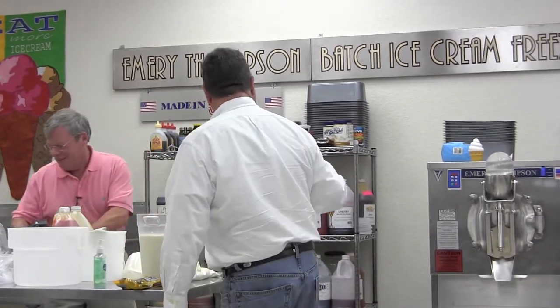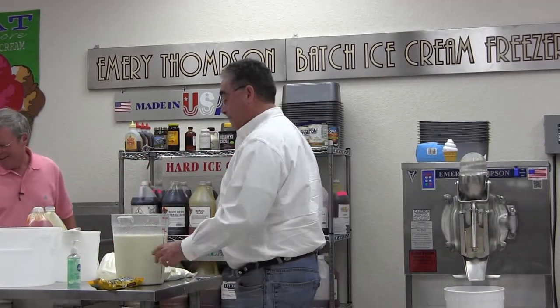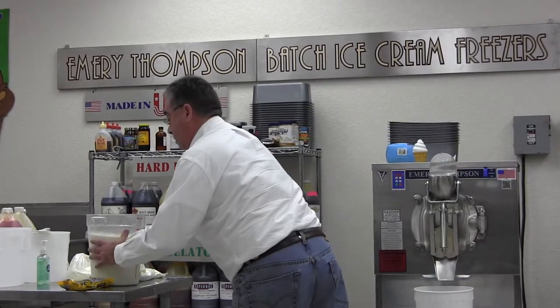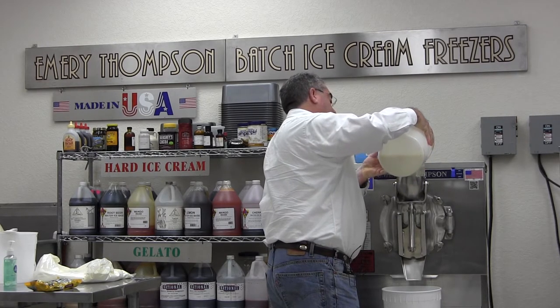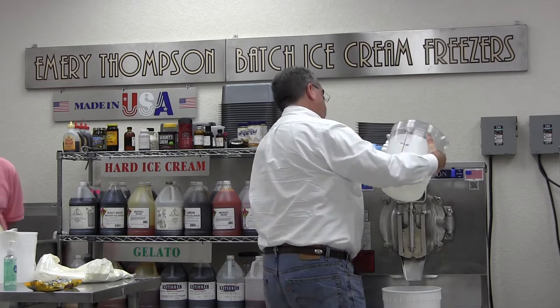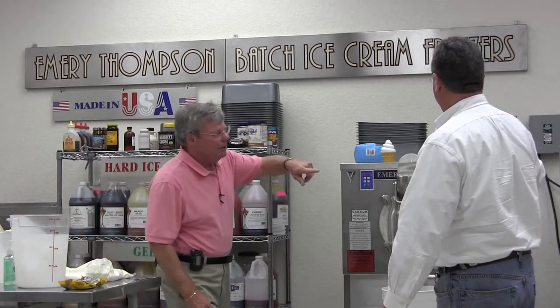Did you drain this? Yes. Are you sure? No. Good to check, huh? Should I drain it into the sieve? Let's double check — yeah, she's drained. Is this closed? It's closed. Okay, ready for takeoff. I'm just going to pour the mix in first and then turn the barrel on. This is five quarts of 10 percent dairy mix, and you can get this anywhere in the country — any major city has a dairy blend like this. We call it mix, which is a terrible term because it sounds like a powder. You've got to turn on the beater first.